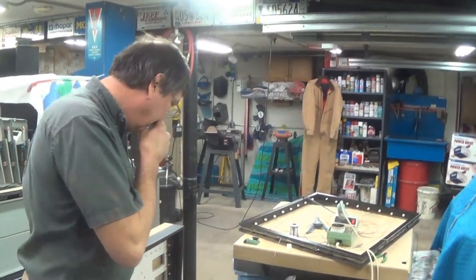Okay. First off, to give the chase effect, you need three channels. Two just appears to blink on and off back and forth. That is not a chase light. You can have more than three, but you don't need more than three. Three makes a chase illusion. Three is the minimum for a chase illusion, yeah. Or running lights, as some people call them. Okay. So how'd you do it? You got 3 minutes left.